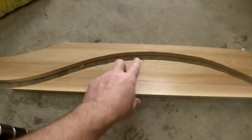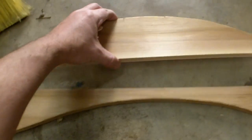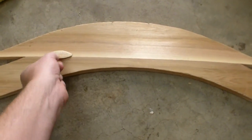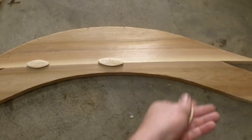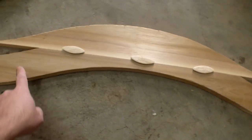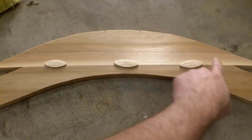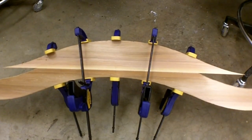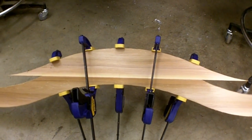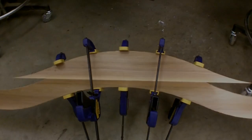I've hacked out those two pieces and taken this one out. This will be glued right here. I'll put in three biscuits, glue and clamp this, and when it sets I'll finish cutting the top of my arch. Here's a quick shot of my glue-up — I just need to wait for this to dry, then I can cut the rest of it out and finish it up.